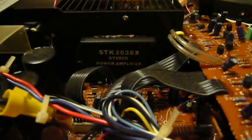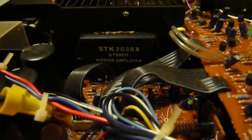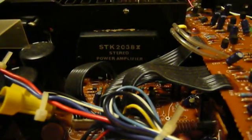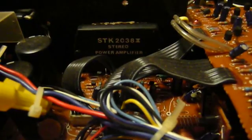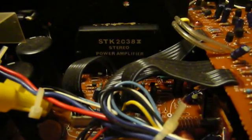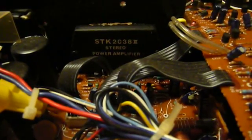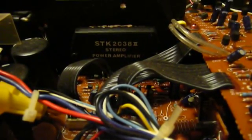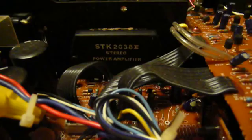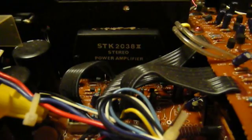To help explain some of the things I'm going to say about this receiver, I need to talk a little bit about audio amplification. Audio amplifiers exist in several different classes, or ways that the circuit operates. The first class, known as Class A, is typically a very high-fidelity method because there is no switching distortion between a push-pull output's pair of transistors or vacuum tubes. A Class A amplifier is extremely high-fidelity and doesn't produce any clipping distortion in the signal as it's amplifying.